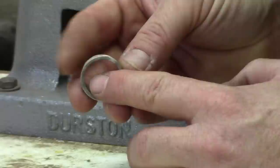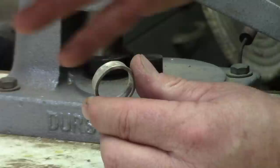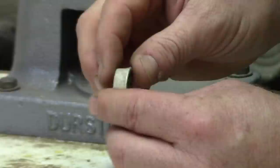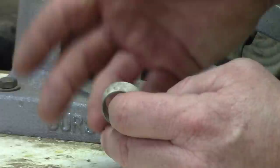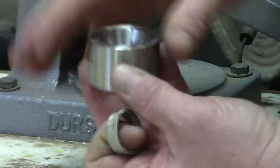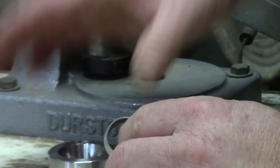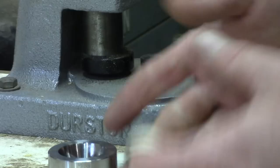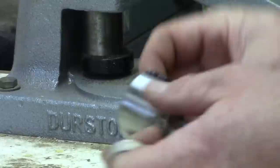The ring is folded, stretched, and now annealed. We're going to go to our final step and reduce it to the shape and size that we want. You'll see it's a little bit wobbly with a couple of low spots and high spots — that's to be expected, mainly because coins are thick and thin in different locations, so they'll bend faster or slower as they're folded and stretched. With the reduction dies, this actually helps to straighten the ring out because it'll press down first on the part that is in contact, then conform to an even look. If you still have issues, put it back on the stretcher and stretch it back out, then reduce it down again — kind of like kneading dough to work out air pockets.